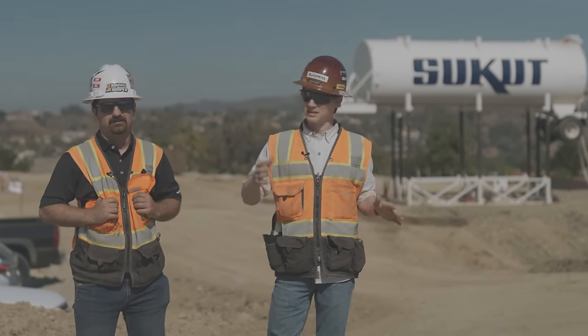Eric, what did you think about the scrapers? Move big dirt, real fast. They're loaded at around 40 yards of material at about 3,000 pounds a yard - that's 120,000 pounds of earth being picked up and moved at 30-plus miles per hour every time these things open and close the apron. That's a loaded lowboy inside the bowl moving downhill at 30 miles an hour. Let's head to QuinCat.